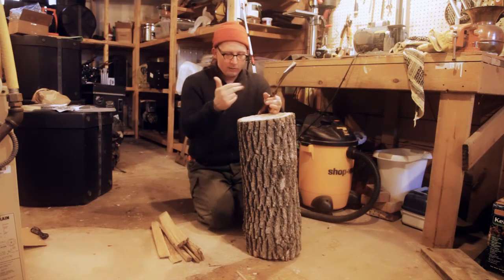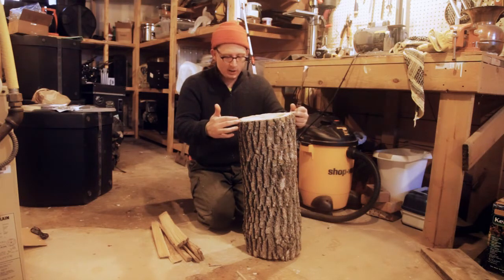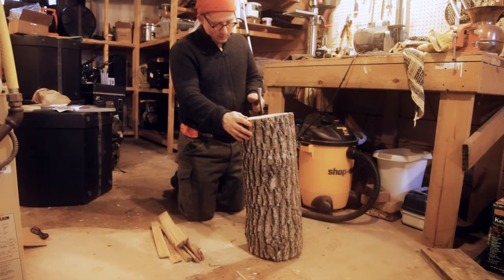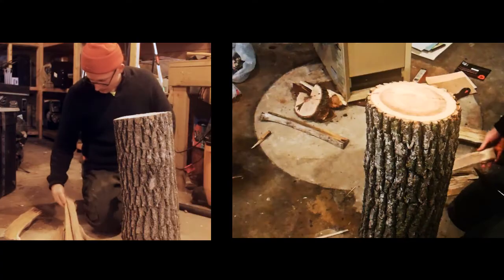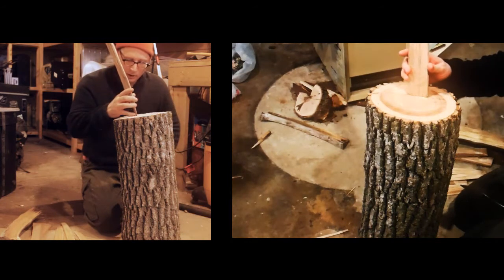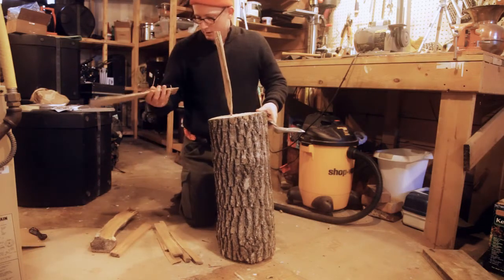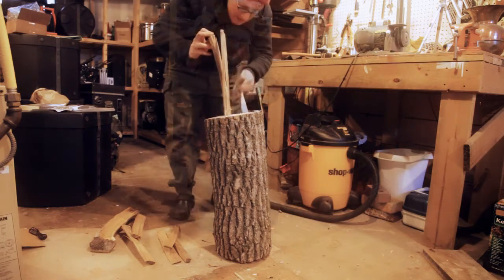When he showed it, all of the wedges were in one side of the wood, and I think I would have a hard time doing that. I think I'm probably going to have to put wedges on each side, and then also a wedge in the end to kind of drive the split. I'm just going to make a little marker score in the top here and carry that across. So now I've scored across the top and I'm going to pick a nice stout wedge. I'll put it in the center and just start tapping it in. This center wedge is a little bit too thick, so I'm just going to trim it down a little bit. That should help.